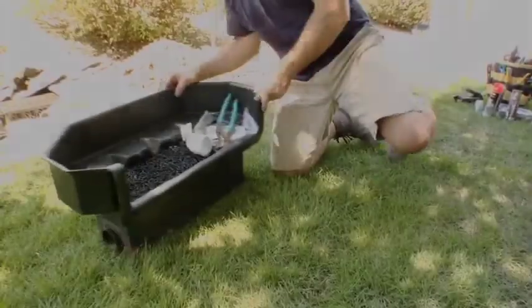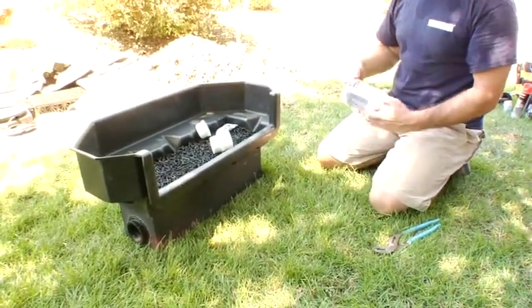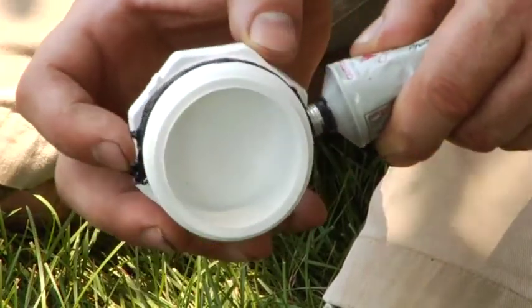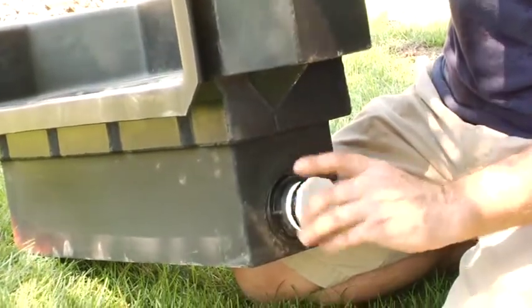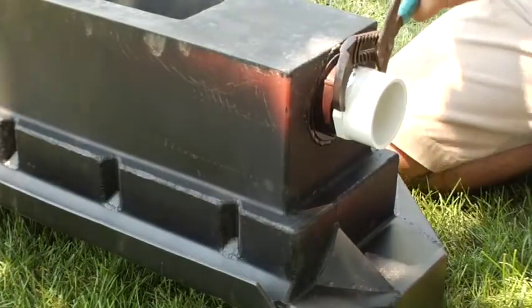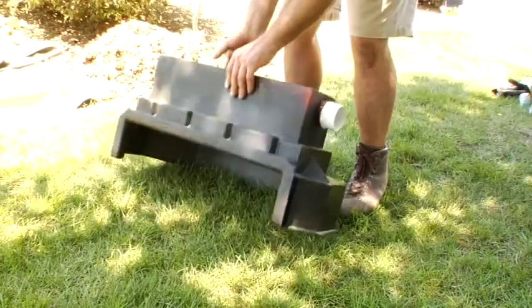The Elite Cascade box is plumbed with a spin weld fitting on both ends. Your kit contains a male adapter and a threaded plug. Teflon tape the plug. If preferred, you can add a light bead of silicone to the fittings prior to installation and thread it into the spin weld on the end that you will not be using. Teflon tape the male adapter and thread it into the spin weld on the end that you will be bringing your flexible hose into. Now your cascade box is ready to be installed.